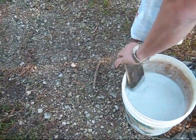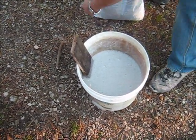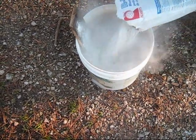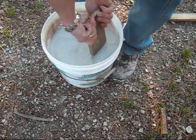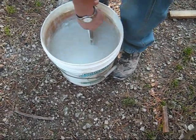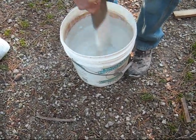We're filming our first batch of mix. The stuff we're using is thin set mortar. The purpose of parging is to give us a nice flat base for the ceramic, and in this case it's covering over the subfloor to prevent any shifting underneath the tile so we don't get cracking in the future.